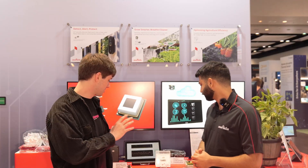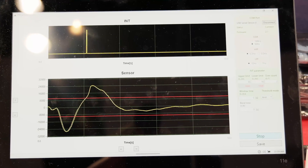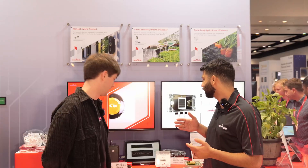This is mainly used for human detection — what's the maximum range? That actually depends on the lens. The field of view and range all depend on the lens, but generally for outdoor security cameras, 10 to 15 meters is easily achievable. For configurability, you can see this demo kit here — you can set sensitivity by pulling the thresholds in or out, set the window time, and configure how many threshold crossings are needed to trigger the interrupt. It's very configurable and can be made as sensitive as you want.